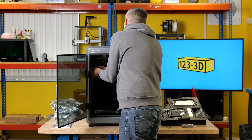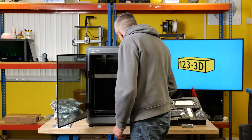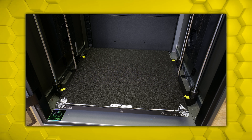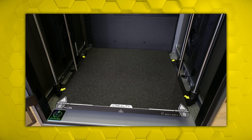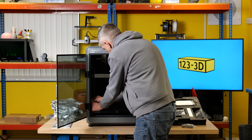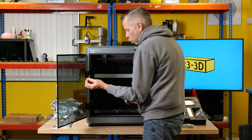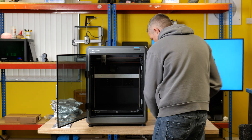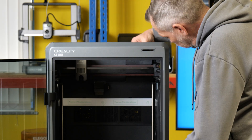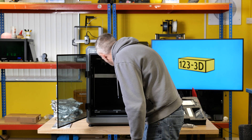Basically they're holding the lead screw central. Next up I can see here we have four yellow arrows indicating more transport screws. So anybody familiar with the K1 series, very similar thing. Apart from in this instance we have four of them. They're located in a slightly different place but very, very clearly marked with the yellow arrows, so we just pull these out. We have this little tab which the heat sink's faced with, and it also has a sticker on the back here.